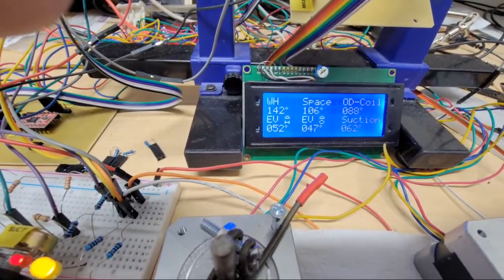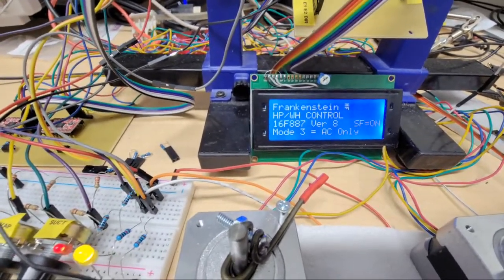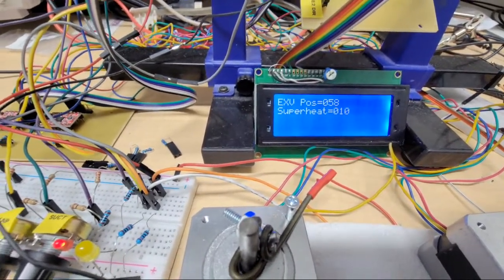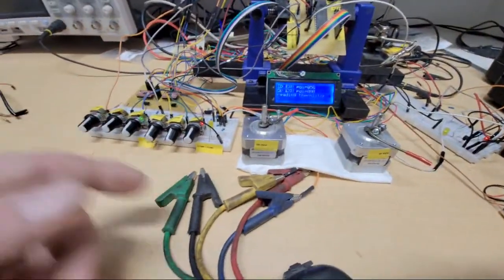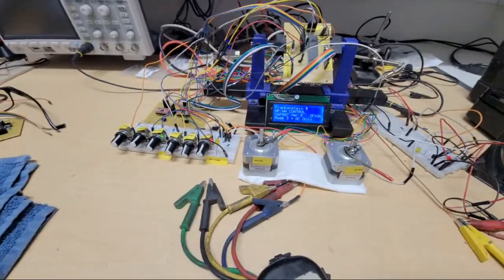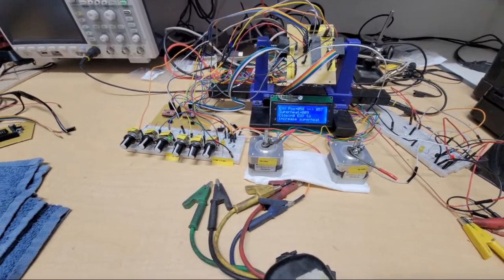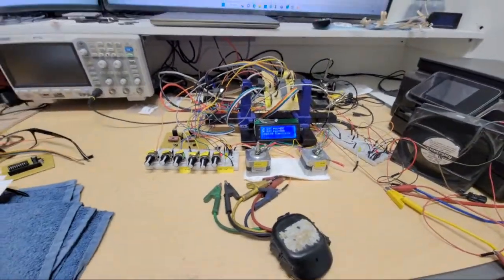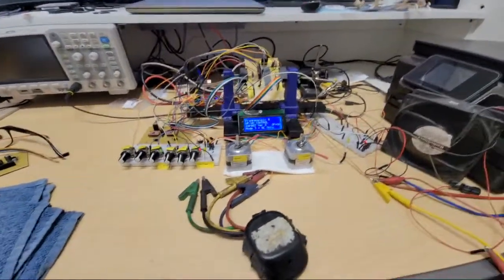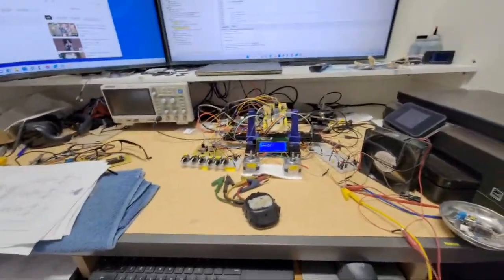So it's reading the sensors. Now it's 142. So next time it goes through to the mode decisions, which is right here, coming after this, it's going to say mode switch, hybrid AC only, basically, back into my TXV. So the only thing it did there was a quick mode switch. It just needed to stop the pump. It's just not going to reject heat into the water heater because it'll get too hot and lift the pressure relief. The outdoor it has in series now, which it didn't have before on my last Frankenstein, is that my last Frankenstein was only the water heater to reject heat, where now it's the water heater and then through a couple passes of a coil, or half that coil that's out there actually.